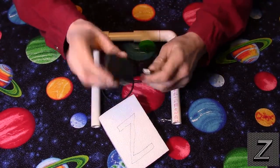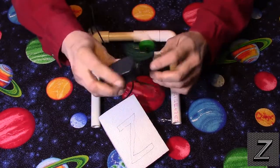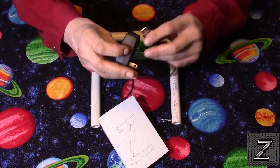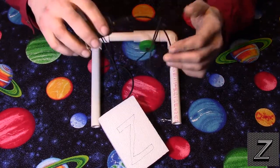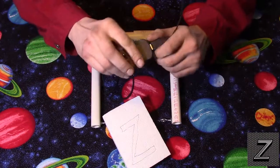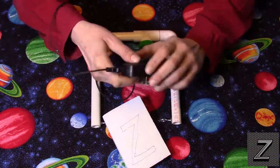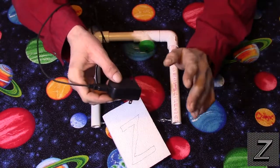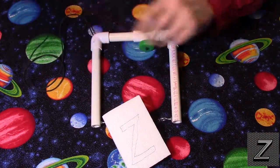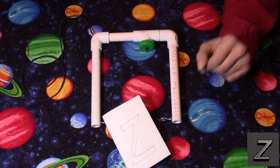So first I've got to plug it in, and what we're using here is one of these little USB phone charger wall plugs. You do not want to actually plug this into a computer. If you do, do so at your own risk. I don't know if your USB port on a computer is going to be able to supply enough amperage to run this, and it might short something out, so I don't recommend it. I recommend using one of these. So, alright, I got it plugged in.